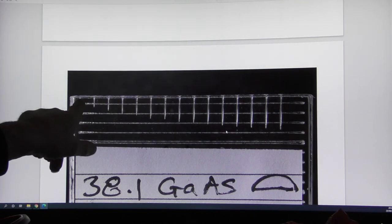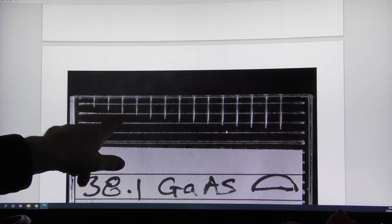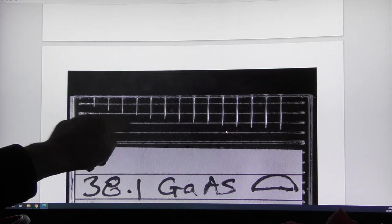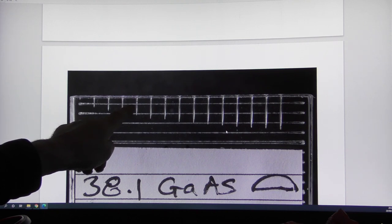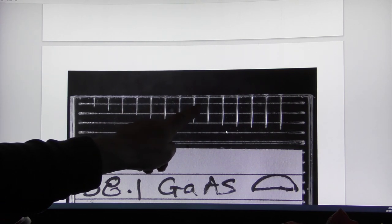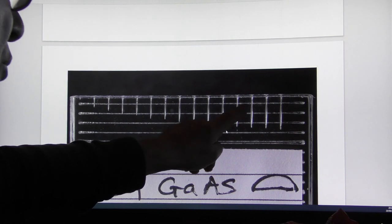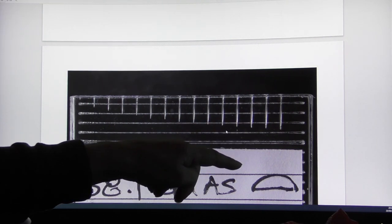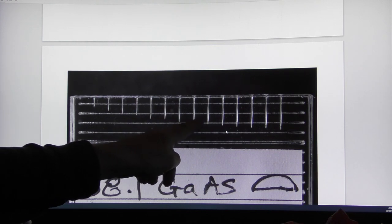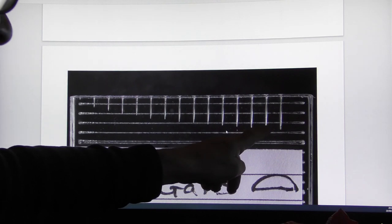Now, there's an interesting one. If we look at the way the beam is growing, 2, 4, 6, 8. There it is. That gets to 4 millimetres in 8 milliseconds. But something else is strangely happening here. If we start looking at this line here at about 2 millimetres, we see something strange happening. It's developing just here, and it starts to develop definitely along here. Look, we've got almost like a waist, a focal point, which sits there at 2 millimetres all the way along. And then look what happens after that 2mm point. We start getting ballooning of the cut.